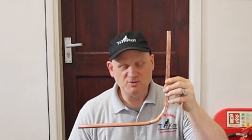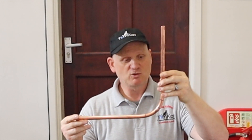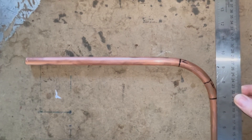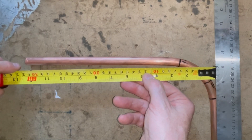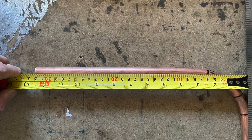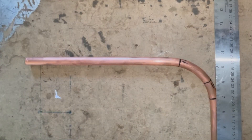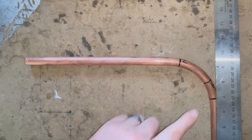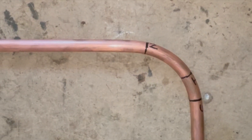If that was brought to me under assessment conditions, I'd have to measure from the end to the centre to see if it is 320mm — and I would deem that a perfect 90 degree bend. Shall we measure our measured end to see if we're in the centre? You can see we've set our set square up in the middle of the pipe. We get our tape rule out and go from the edge of the set square to the edge of the pipe. You can see quite clearly there it is 320 millimetres centre to end. I have just produced a perfect 90 degree bend from 320mm from end to the centre of the pipe, and you can see the perfect bend within the radius markings.